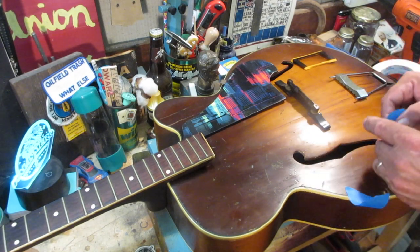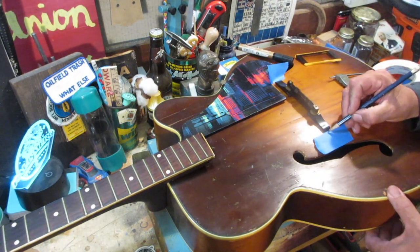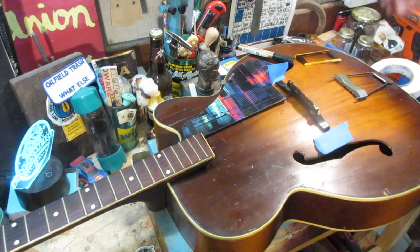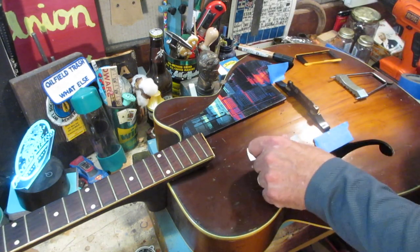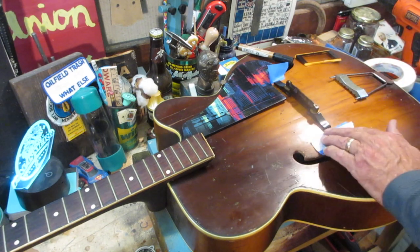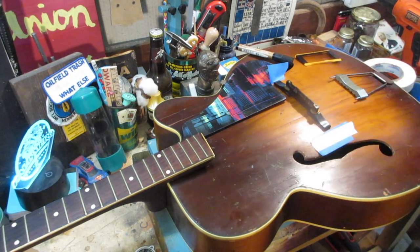When it comes to marking this off, I've got painter's tape here. I'm going to put pieces on either side and take a pencil to mark the center of where the bridge goes. If you're working on a fancy guitar, use low-tack tape like this white tape, because if you leave regular tape on in a hot shed it's going to peel up the finish. This orange tape is between white and the blue stuff in tack rating — it stands up good and protects your surface.